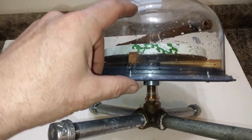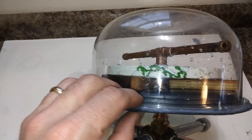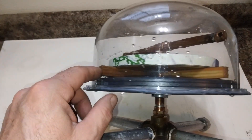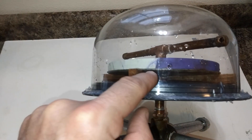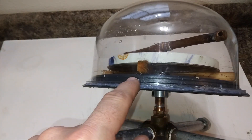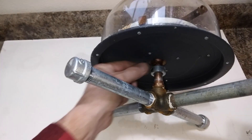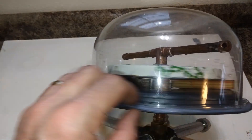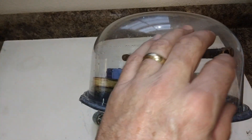As the water makes its way to the exit, there are wooden blades that go towards the center. That rotating flow pushes up against these blades, causing the rotor to build up torque and spin as the water makes its way out through the exit. This is a very inexpensive build — made for demonstration, for viewing, and to study what's happening as it works.